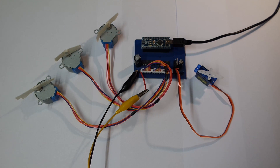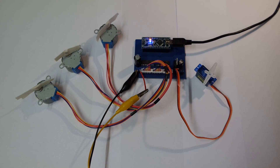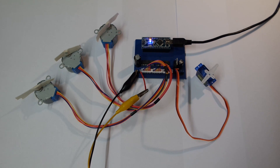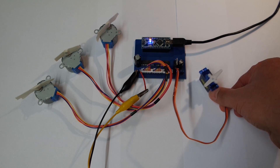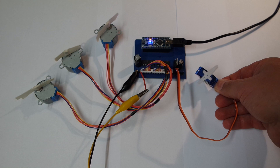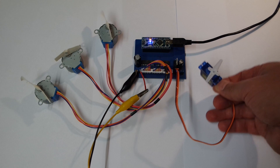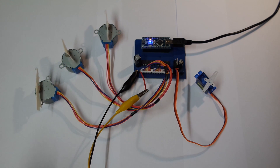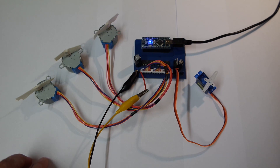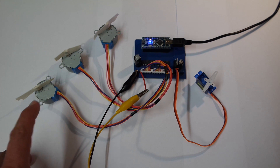I'm going to plug it in now and it's going to go through a set of self-tests. These are pretty interesting because you can already see that although this is basically the first version, it is already pretty fast. First it is going to test the servo — it will move to its maximum positions forward and backward at different speeds. After that it will do something I call servo emulation, so you can use the servo like a stepper and vice versa. Then it tests several iterations of the Bresenham algorithm, which I've integrated into the stepper class.